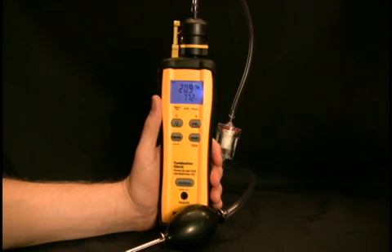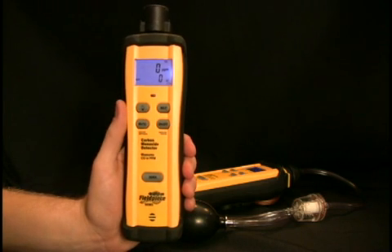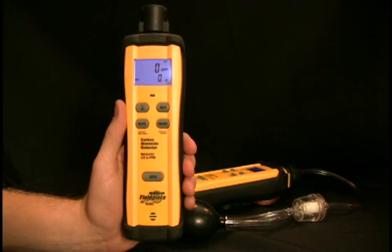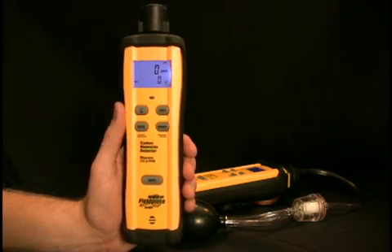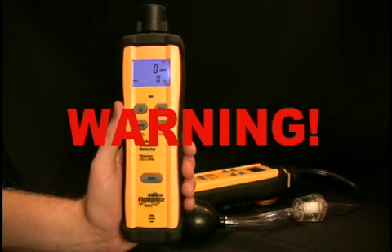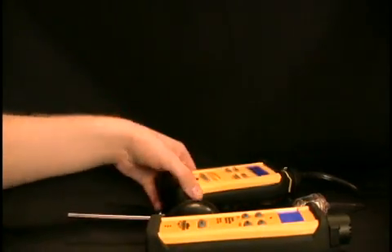The SOX2 is a great tool and inexpensive way to check if combustion equipment is within manufacturer's specifications. Carbon monoxide can be a byproduct of the combustion process and can be very harmful even at low levels. Be sure to get training for installing and maintaining combustion equipment and the dangers of carbon monoxide before doing any work on combustion equipment. If you are trained, a great partner to the SOX2 is the Field Piece SCM3 carbon monoxide meter. See the SCM3 video on YouTube for more product info. Thanks for watching — that is the Field Piece SOX2.